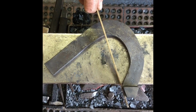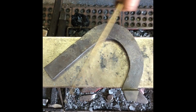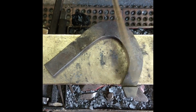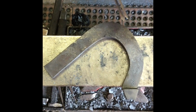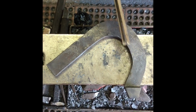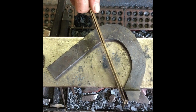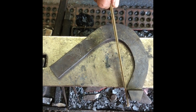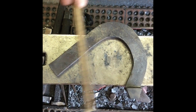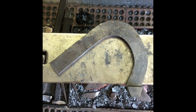This comes up the commissure. This angle would be the same as this angle. This angle would be the same as this angle. And if you have a real wide quartered horse, then these obviously would be wider. If you have a straight, more Frisian type foot that's got little quarter or no quarter, or a fjord, this would be more blocky. But that's how you can get it to sit on the foot without being over one side or the other. That's what you'd like to have before you start on to the next side.